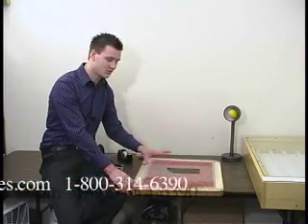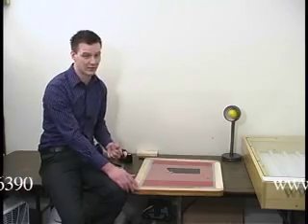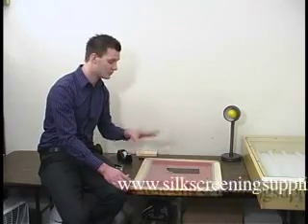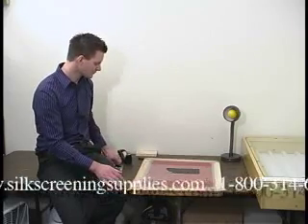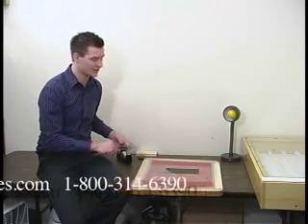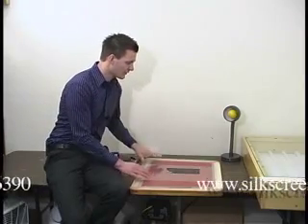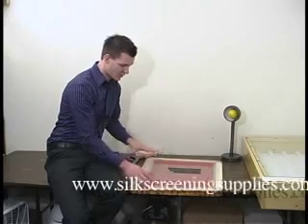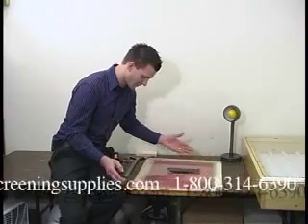The presses we're using — the pallets slide back and forth, and the press that is going to be printing this job has micro registration and joystick micro registration, so it's not going to be as critical. But you do want to make sure that all your films get in the same spot on each screen, and that they're level and square to the screen itself. Since this film is fairly large we don't have to measure as precisely — we can almost eye it up on the screen itself and we can see this film is pretty much centered.